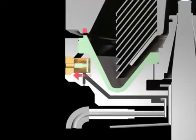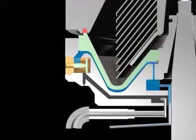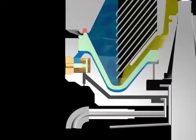With the hydraulic pressure from the valve opening water removed, the pilot valves once again move outside. The supply of the valve opening water, which had been stopped during sludge discharge, is now resumed. When the bowl is filled with the valve opening water, hydraulic pressure is generated, pushing the valve cylinder upward to shut the discharge outlet. Sealing water is supplied into the separation chamber, and dirty oil operation begins.